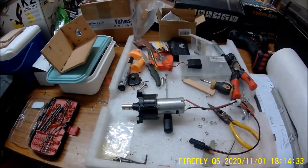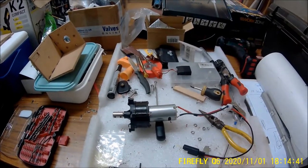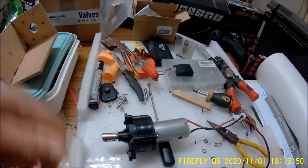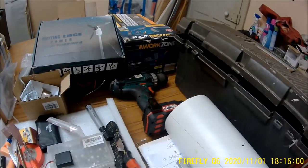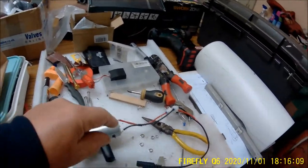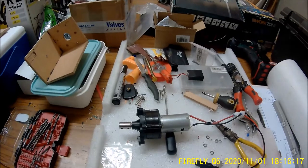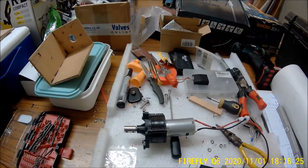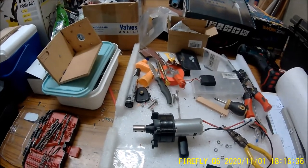I'm sure you've seen these hand-cranking generators. I got one out of interest. The first thing I noticed is that it's very hard to turn — you need quite a bit of torque and the crank handle to turn it. I have a battery drill with two settings, 400rpm and 1400rpm. The generator says max 120rpm, but for a bit of fun I put a diode on it, connected it to a 12V battery, and started turning it at 400rpm — it was putting in over an amp into the battery. Fairly soon I noticed the back-force was putting quite a bit of load on it, and the little nylon gearing wouldn't have lasted.